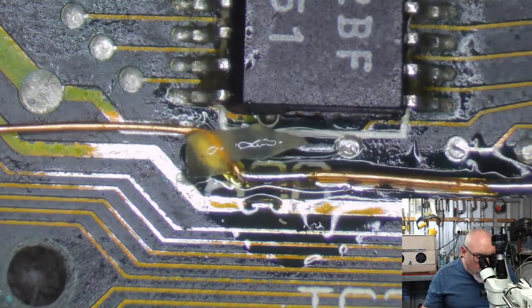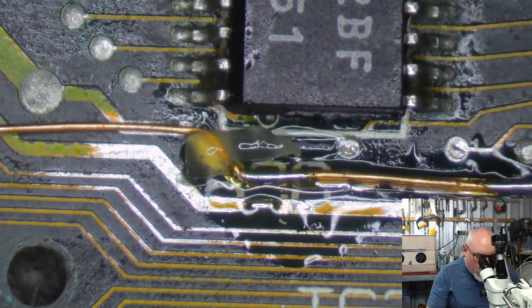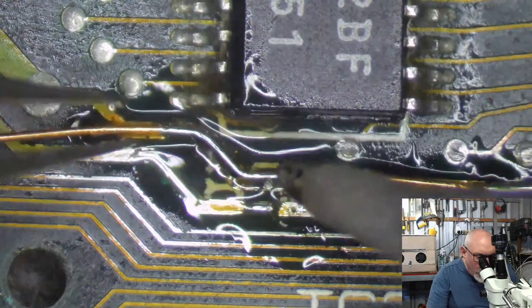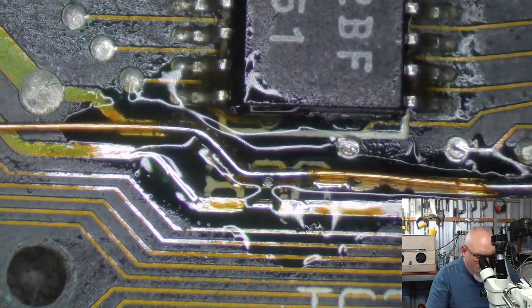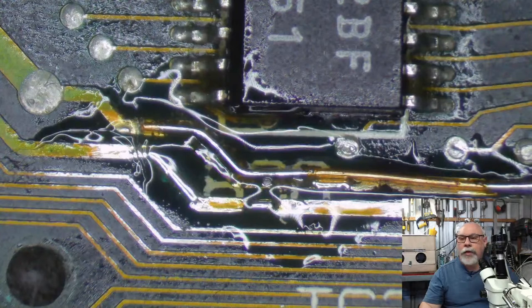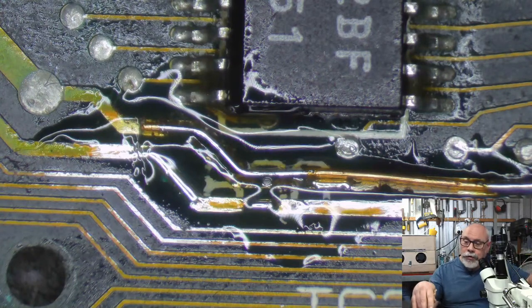What you can do, and this is what I have done, is hold down Shift Option Command Delete on a Mac. See, normally when a Mac boots, it boots from SCSI ID 0 up. So it tries to find if there's anything at 0. If there's nothing at 0, it tries to find anything at 1, and 2, 3, 4, 5, 6. So it goes from low to high when it's booting. If you hold Shift Option Command Delete down while the computer's booting, it goes the opposite direction. It tries to find its SCSI IDs from 6 down. So if you have an internal hard drive that's set on 0, and then you put in an external hard drive that's set at 6, and you hold Shift Option Command Delete down, it's going to boot from the one at 6 rather than the one at 0.